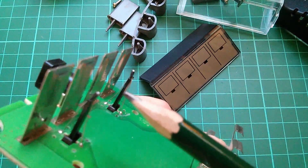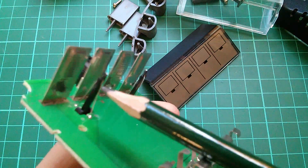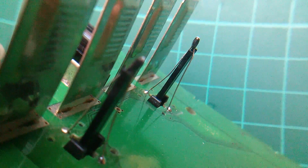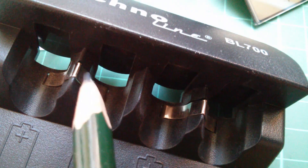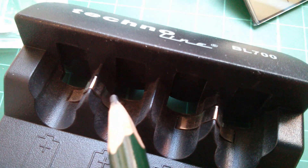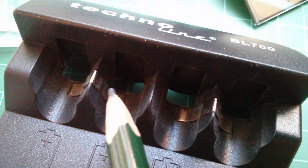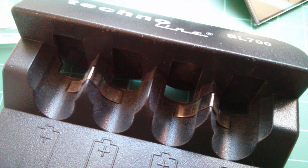You can also see mounted up on these little plastic perches two thermistors. You can see the two wires running into the thermistor, sitting up on top of that plastic mount. Those thermistors sit up inside these little metal inverted-V shape things, so you're only measuring the temperature of two cells at a time — there are two temperature measurements, sharing between two cells. That's how it does end-of-charge detection if the cell starts getting very warm. There's also a timer, a total charge end-of-charge detection, and then of course the main one: the delta-V — that watches for a tiny dip in the voltage of the cells, which is characteristic of the end of their charge sequence.